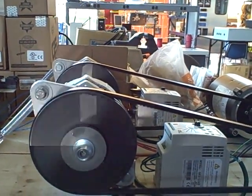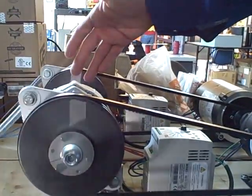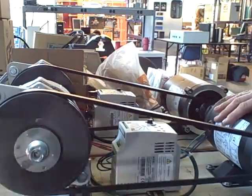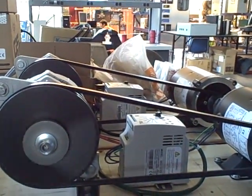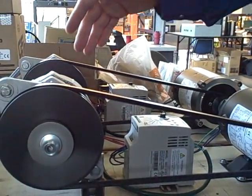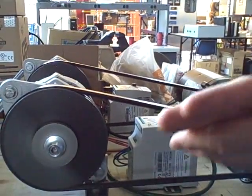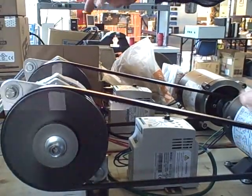What I'm going to do now is purposely slow down the prime mover on the foreground generator — slow down the frequency going to this motor so it tries to spin slower. Since these two generators are still electrically linked together, they will still spin at the same speed, but this one won't be trying to spin as hard as before. In fact, it will be trying to slow down, and as a result, this will begin to act as a motor, and the background generator will act as a true generator.